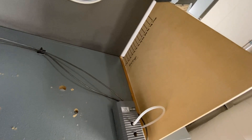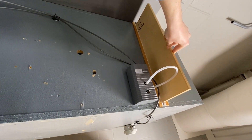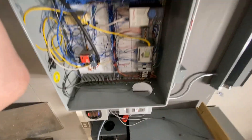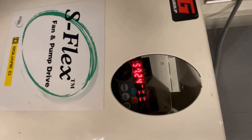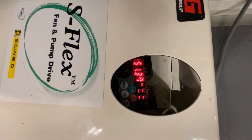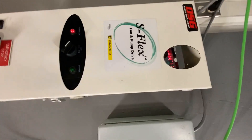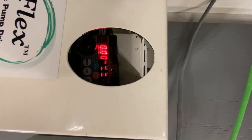I'm going to close up this blockage here and the motor will begin to slow down because it's not going to have to work as hard. So it closes up to about there. If you listen you'll be able to hear the motor wind down, and here you can see the frequency begin to go down. Looks like we're going to be around 50 there. If I turn it off here, you can see it go back down.